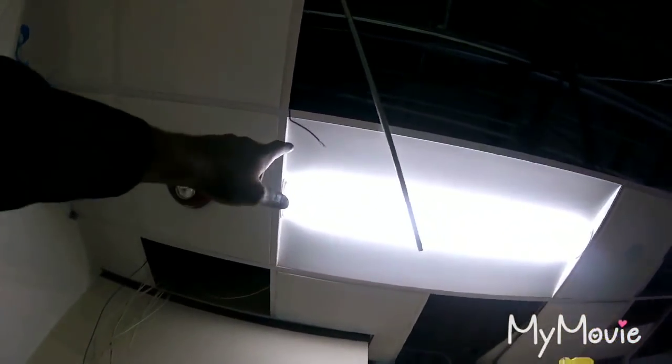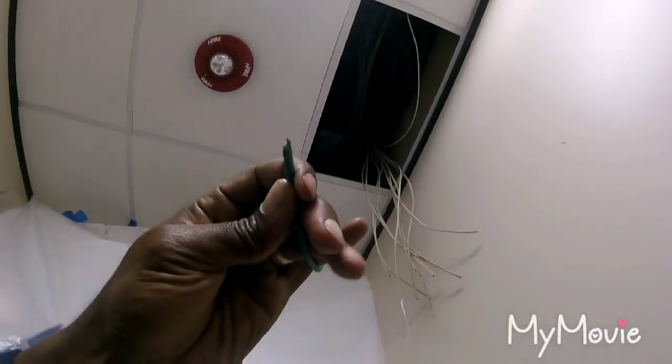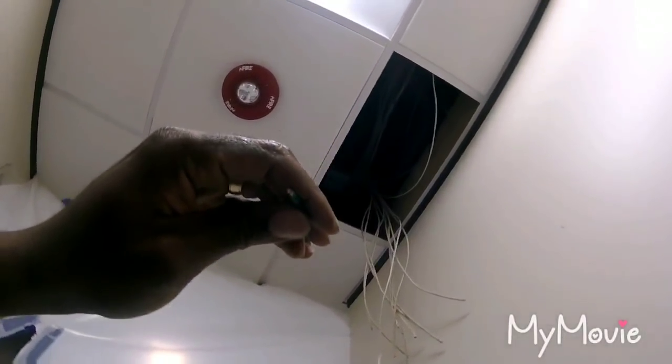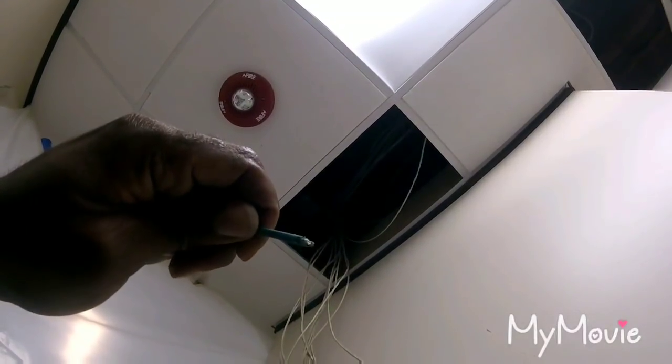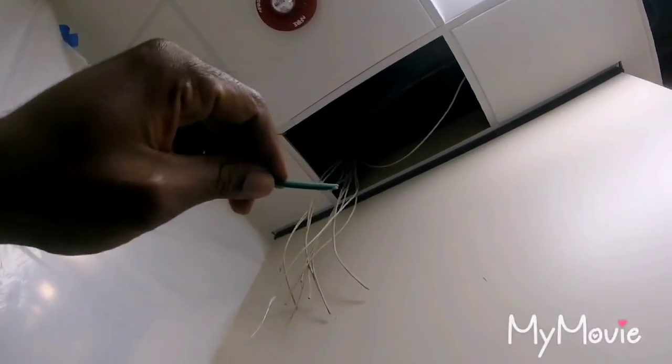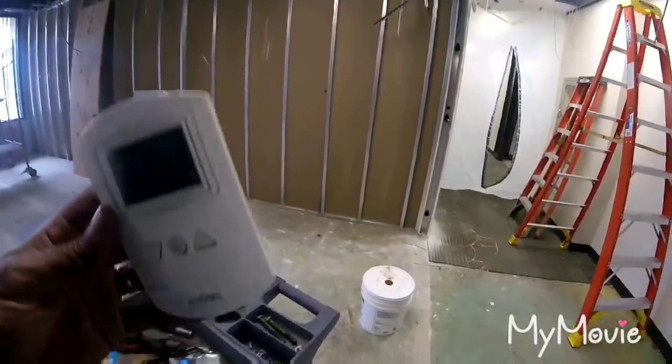All tasking for today: the green wires — CAT6 — was cut during a demo. Instead of the demo team taking it off the wall, they just cut it and threw the wires back up. So I've been going all morning popping ceiling tiles trying to find this wire. I found both of them — the ones I need — because it's making my hot deck cold air damper open and close. I'm going to install two new sensors because they threw the sensors away. These are the KMC control sensors that I will install.